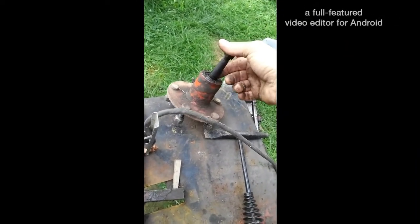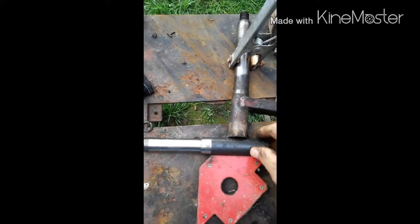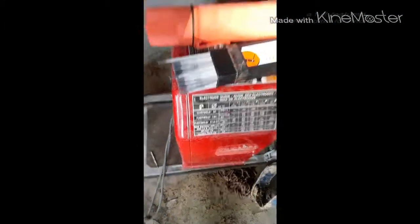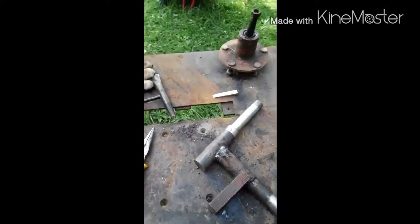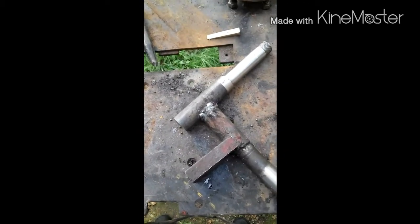I would expect to see this on a go-kart, not a tractor. And these are actually made for trailers, so they'll work fine. I'll weld this up at 85 degrees — I've got an angle welded up so that it goes off. I used 7018 AC, cranked up to 120. Burn it in real slow. Of course, I'm not a welder, but I can stick two pieces of metal together. It ain't pretty, but it works.